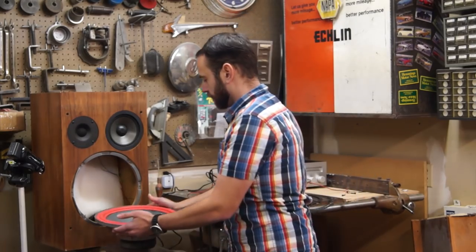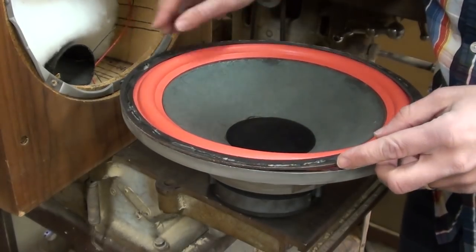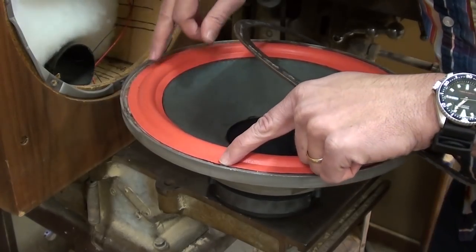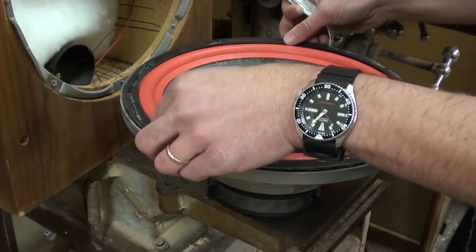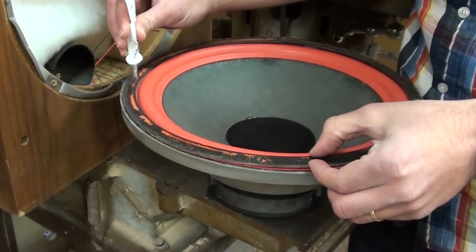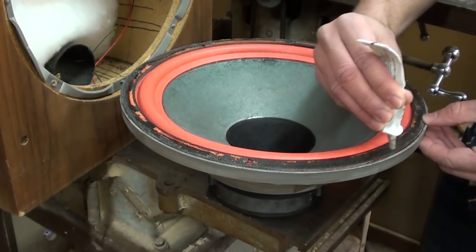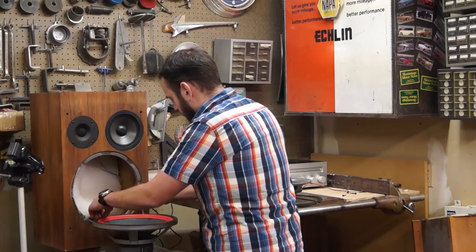The next step is to go ahead and replace this bit of foam we removed earlier — the one that covers the speaker surround and has access holes for the screws. We just line this up with the screw holes and use the exact same glue as before, though we don't need nearly so much. This side has a little remnant of the old foam on it, so we know which side goes down onto the surround. We just get a little bit of glue and reapply this — we just don't want it flapping around and buzzing, so just enough to hold it on nicely.